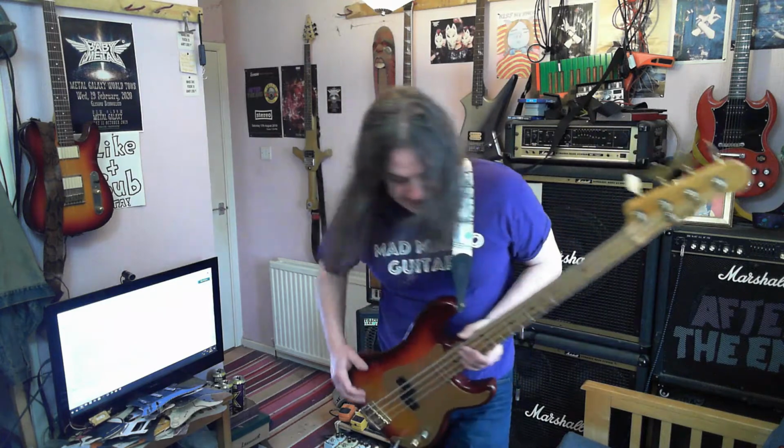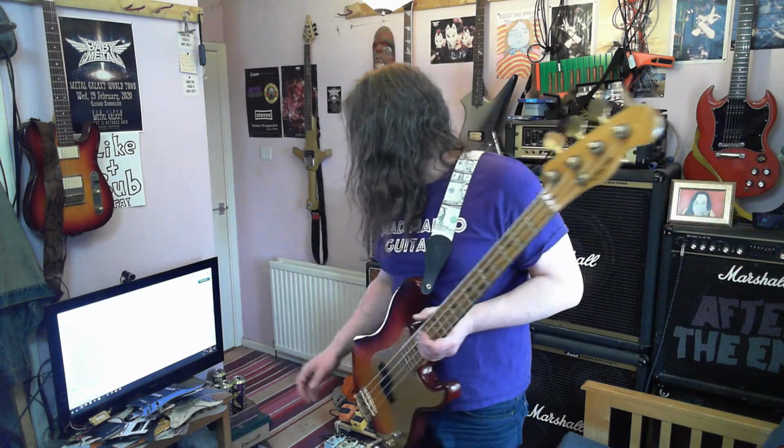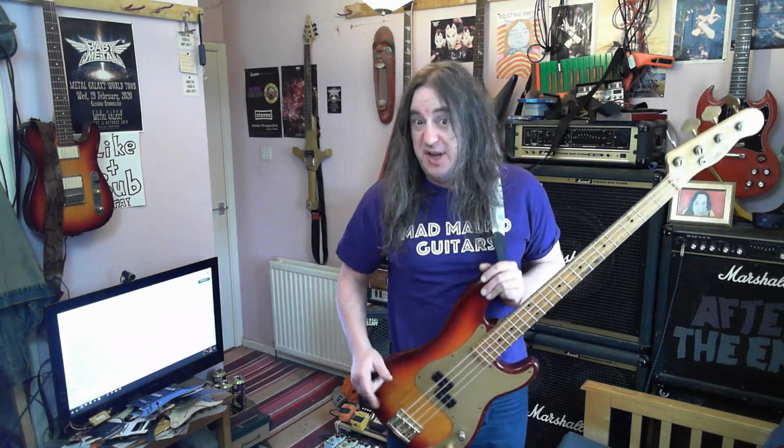Yeah, so that was the G-201P, which I think is probably worth it if you've got something like what the chap had done. He hadn't wired it up right, it wasn't working when I got it in, that Westone Thunder. But if you've got something like a Westone Thunder that's got a crazy circuit board that's gone, or the Thunder 1A, or the Thunder 2A, A for active, you could pretty much just put that in and it does the same sort of job as a boost circuit.